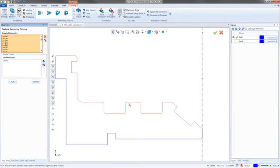If you have bad geometry, if you hold shift and click on your part, wherever that chain stops and turns back to your normal blue, that's usually where there's a problem. So be careful, but definitely if you get a problem, go fix it now. Don't try and struggle through it. I've done that before. It never works, and you just end up ripping more of your hair out throughout the day. And I ain't got much to spare. So make sure you fix the geometry before you get there. And then when you're done, you can hit OK.